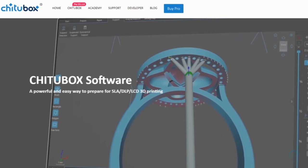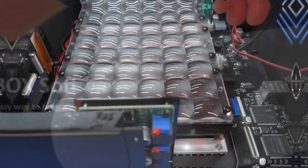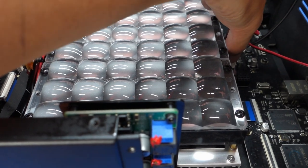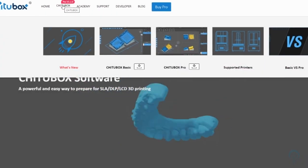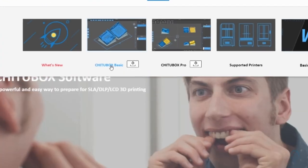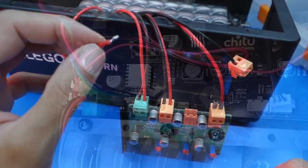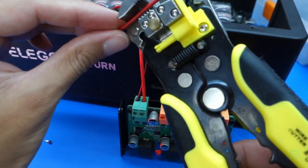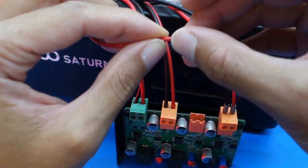The Saturn and the Mono X both require a firmware update prior to using the most recent versions of Chitubox. The Saturn does use a Chitubox board which limits which slicer can be used with the new firmware. Chitubox does provide a free version at this time, but this is not guaranteed to be the case in the future. While inspecting the wiring, I did discover that it had tin connections, which I recommend replacing with ferrule ones instead. I do have a video walking through this process that you can check out here.